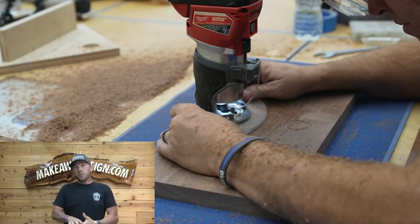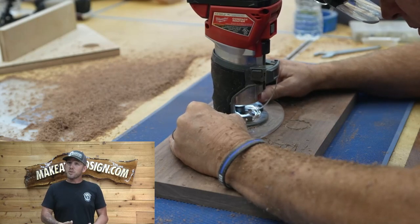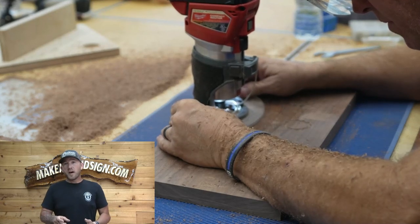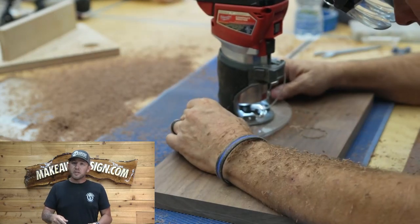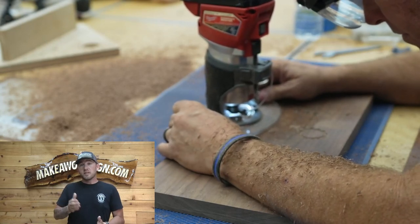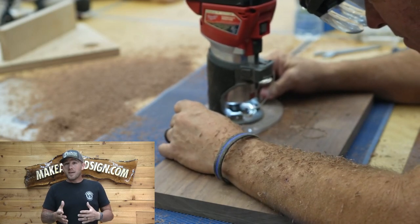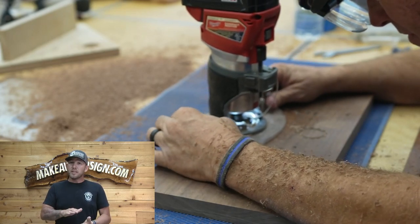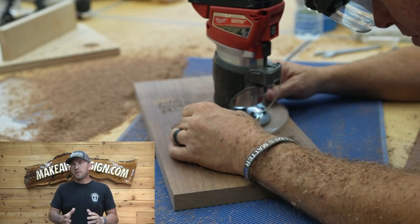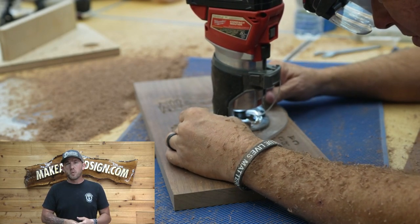Because we have to insert the chargers from the back, we have to drill the big hole and the small hole all the way through. Dad uses the profile bit, again, link in the description, to make the outline for the big hole. And then he uses the quarter inch spiral upcut to go all the way through. Now you can't do this all in one step. You have to do it in stages, about an eighth inch at a time. It took Dad maybe 4 or 5 times around to get all the way through this board.